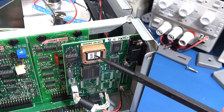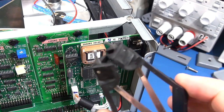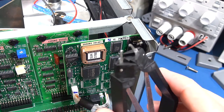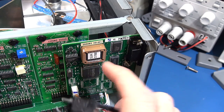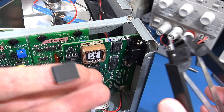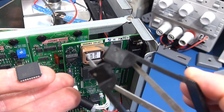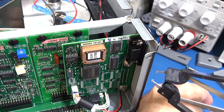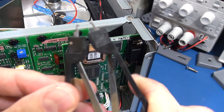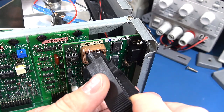Right, so here's the one on the other side. This one might be a little more fun — that's why I went and specifically purchased this PLCC puller. I don't think I've ever removed one of these packages. I went onto Amazon once I had a look at the package Paolo sent me, looked up its identification, then looked up the relevant IC puller. So this could be quite entertaining. This device has two hooks — it's sprung so when you push it, it pulls up, and in theory the IC should fit in there.